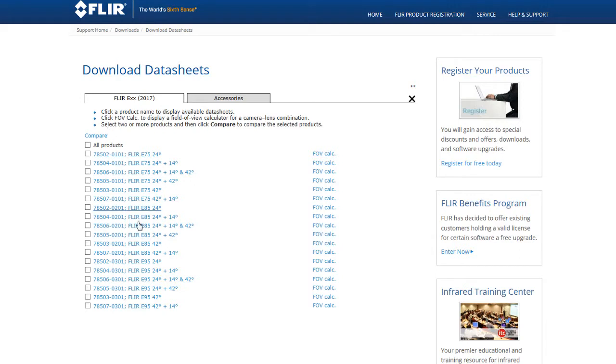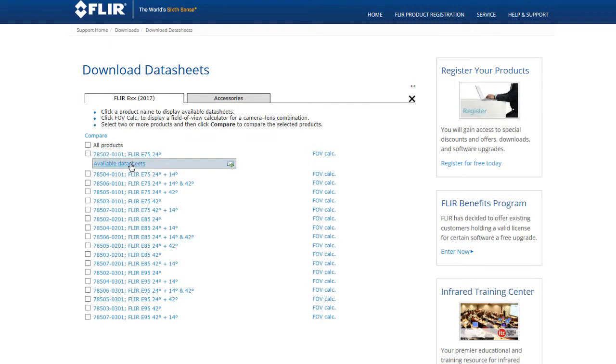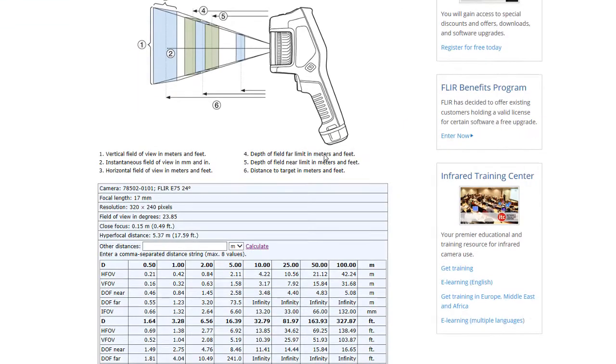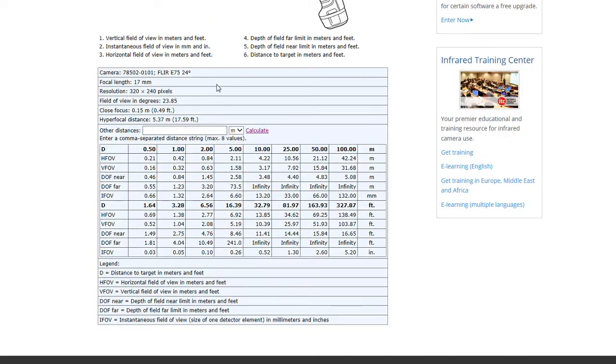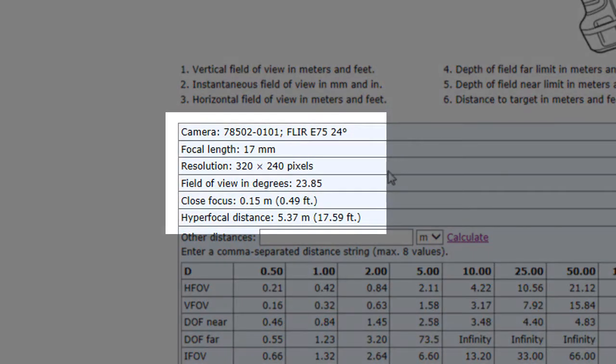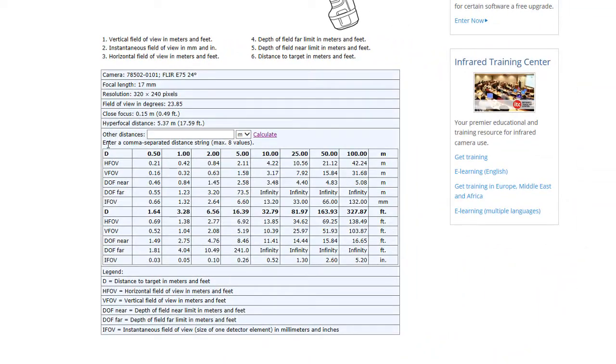Listed here are all the configurations for this model. On the left, clicking any of these links will access the specification sheet for that imager. On the right, however, is where the field of view calculator can be accessed. Select the link of the corresponding camera to open the FOV calculator tool. You'll see displayed some of the specs for this model, including the detector and lens size. Remember from the last episode, resolution is really a function of both parameters. What the calculator will provide is an estimated value for detectable target size at a given distance, with the current lens and detector configuration displayed above.